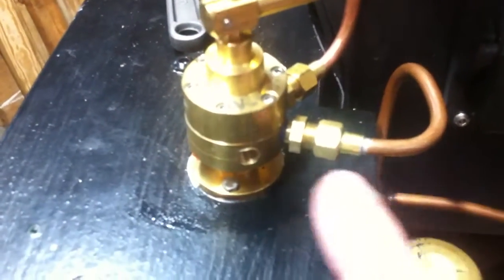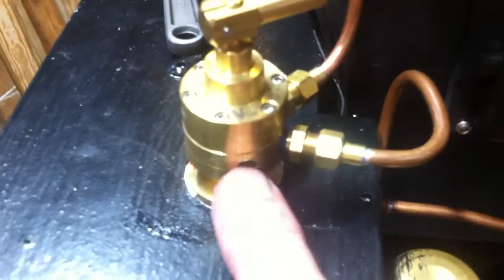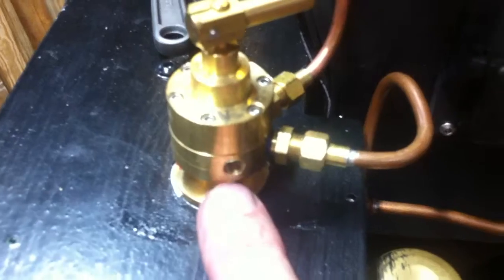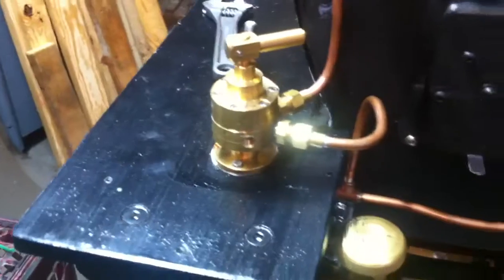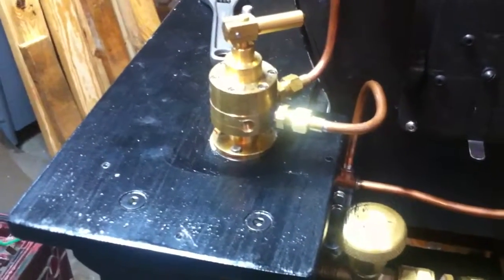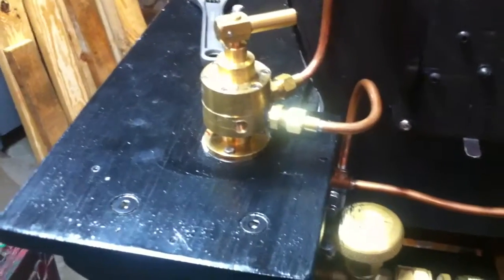So I went ahead and I used a regular starting tap, and then I used that bottoming tap, and I used the trick. You can see some of the residue here. I put Crisco on the taps so that the chips wouldn't go into the brake valve. The Crisco keeps the chips stuck to the taps themselves. So that's tapped and ready to go.